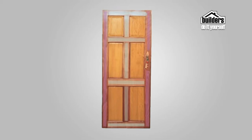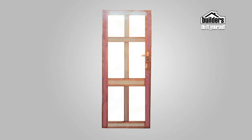When painting a panel door, first paint the inside panels, then the horizontal crossbar at the top. Following the center stripe down, paint the center in horizontal cross pieces. Finish the door's outer vertical pieces before painting the frame.